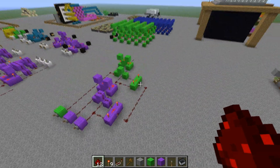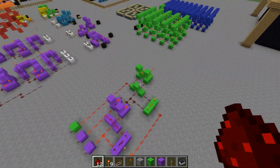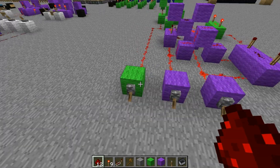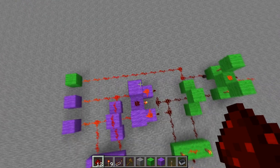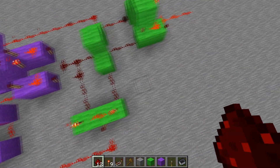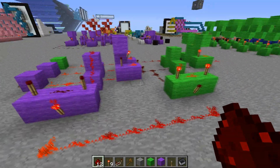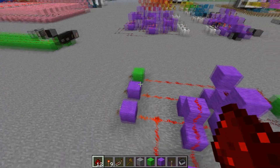The difference is when we add all three together, they will both actually turn on. Because if you think about it, if we add one plus one plus one, then in binary that's a two and a one. So this is our sum right here — this is our one — and then our carryover, and since this is one, this would be our second bit. So then we have one plus two, which is three. So this worked exactly how you'd think it would.